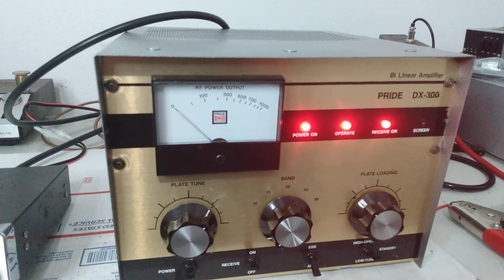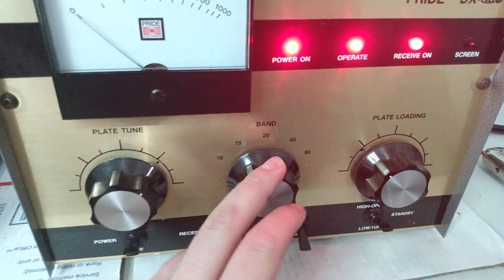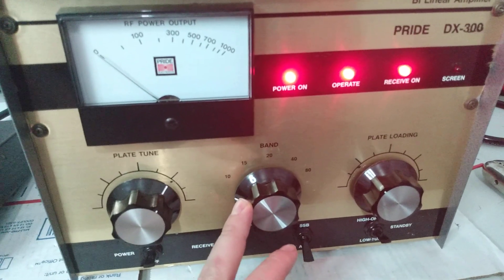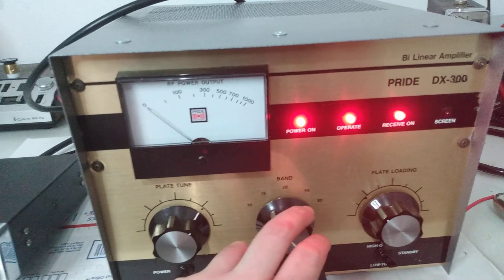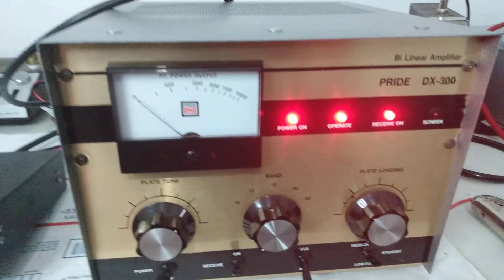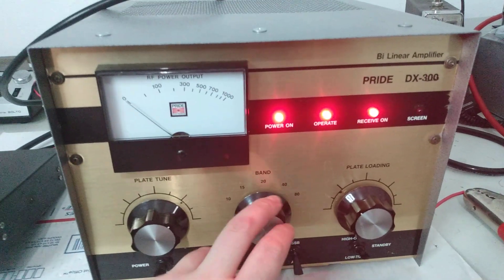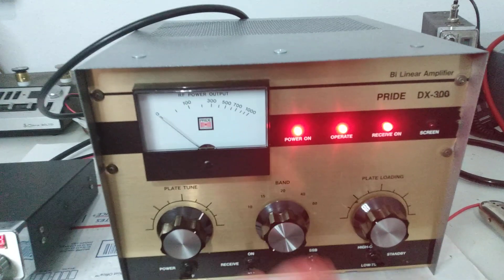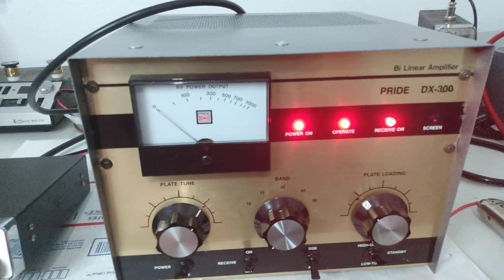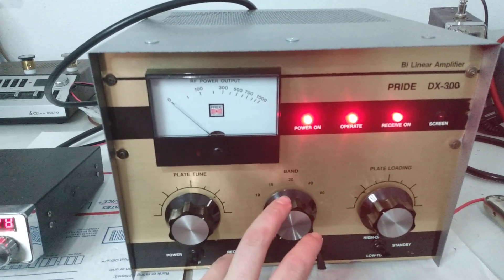Let's talk about the amp a little bit. What has been done to this thing? Why is it so special? Well, Grinder's been through it. The first thing I'll point out — the band selector is no longer a band selector, it's a variable. This thing is like the ultimate driver for you guys that use larger amps. Specifically, something like a 3CX3000, this thing would be perfect for. A 3CX6000 it would drive pretty good, but a 3000 it would be really nice for. Or if you want to run it into something lower, you can dial it back. Maybe a turn-off for some people that like to multi-band, but if you just talk on one band, this is killer having that variable added.